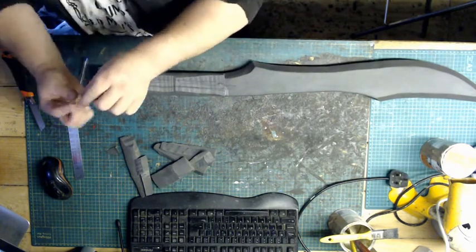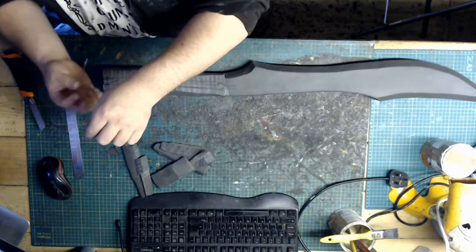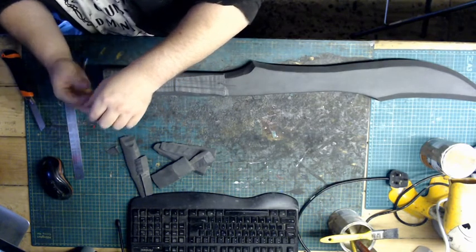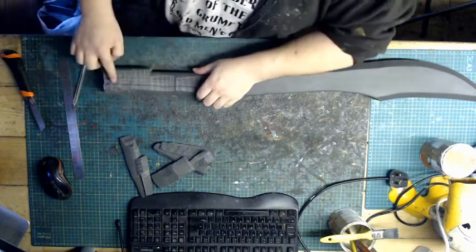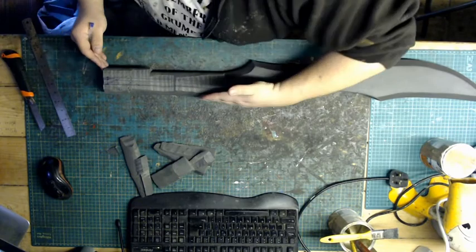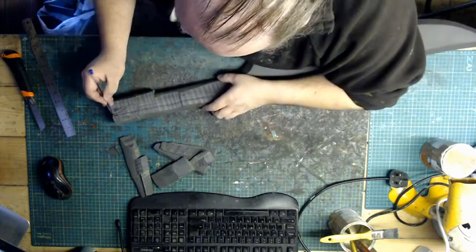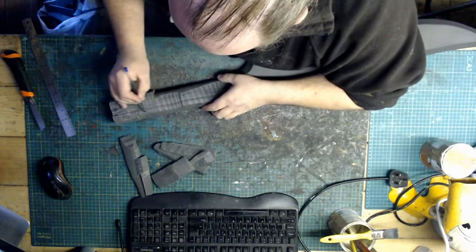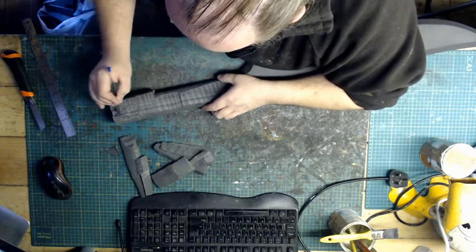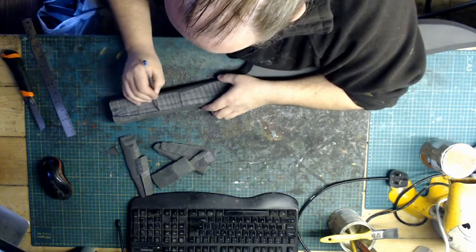So you've got your 8mm core, 5mm on top of that would make that 13, and then another 5mm below that would give you your 18. So 18mm. So if you just go 20mm, I can't go in there. This needs to come down slightly. So I know I can go right up to that edge. So all I'm going to do is go close to it, not quite on it, so I'm going to have about 7 or 8mm.